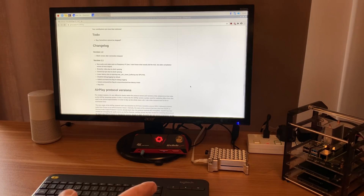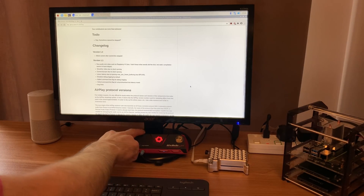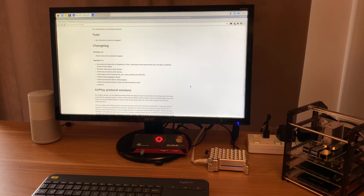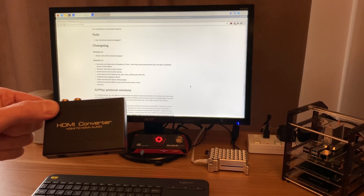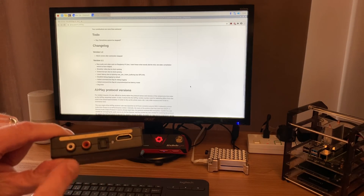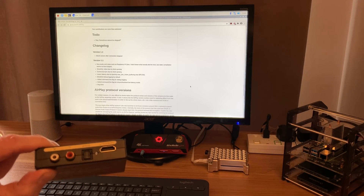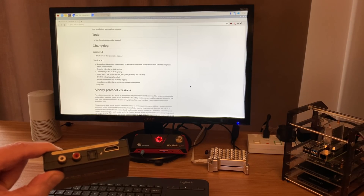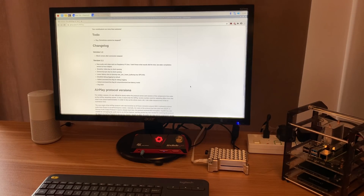I tried and tried to get the sound to come out of the analog jack, but whatever I try it doesn't come out — even if it's selected and the OS is working. I've tried within the graphical user interface and with the command line. It looks like RPiPlay only plays audio through an HDMI output. In this case I can route it through my capture device since the HDMI goes into that, but that's not cheap. The better way is this HDMI audio converter I've had since the Apple TV 4 came out — it has HDMI in, analog L/R audio out, optical audio out, and HDMI throughput. The signal goes from the Pi in, and then analog audio left and right out into the old amplifier you saw at the start. Anyway, I hope you like this — thanks very much for watching, please like and subscribe.